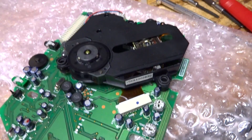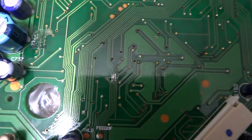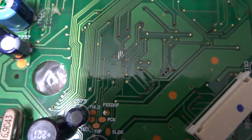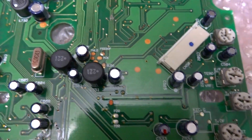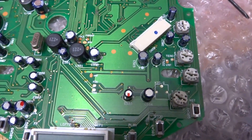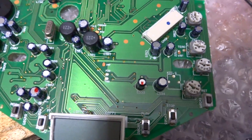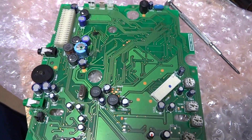Under here there were three traces that I was able to find that were separated or seemed separated — they looked like they had a crack in the middle, so I patched those out. They're actually bare too, so it's really hard to tell what's going on with the machine, especially if you're the second or third person to work on it. The one thing I'm really worried about is these pots — if the previous owner adjusted them, they might all be out of adjustment. Next thing we need to do is replace all the caps.